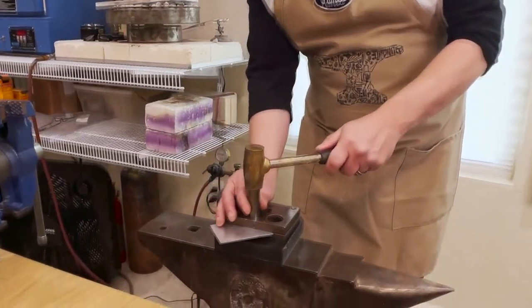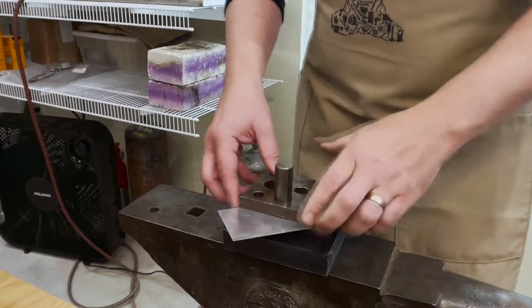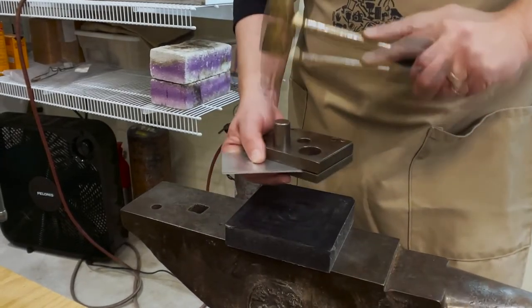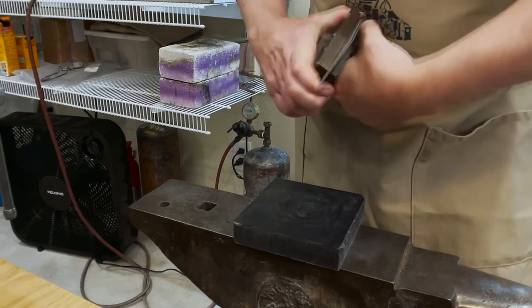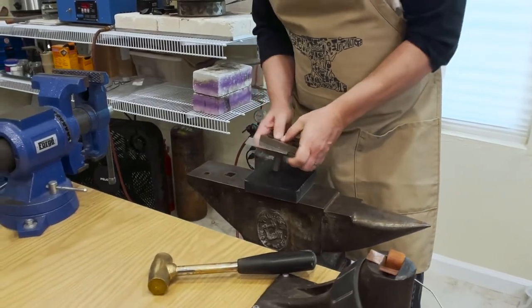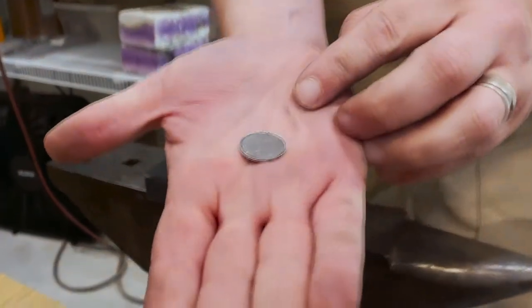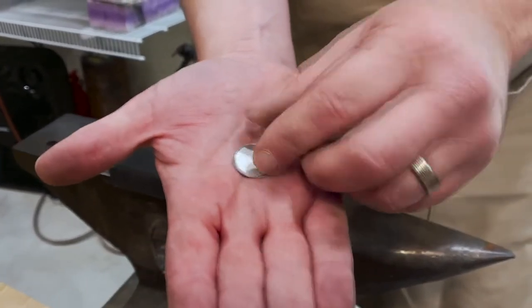You just line that up, hold it in place, and strike a couple times to punch through. It bottoms out at the bottom and the disc just falls right through — that's why I have the protective plastic block on the anvil. I'll gently tap the punch all the way through to get set up for the next time. Here's the disc that it punched out. Depending on the quality and age of the disc cutter, you are going to get a little bit of a burr that you should sand or file off before doing anything more with the discs.